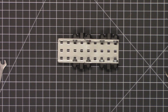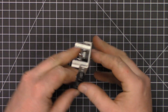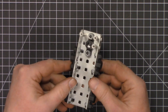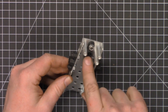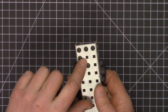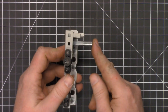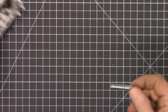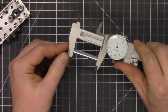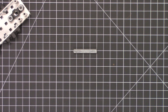Now we're going to work on getting the motor mounted. I've added three standoffs that are one inch in length in this orientation. We also added a bearing. This is one of those high-strength shafts, but notice I did not drill through for this one — that hole is still regular size, which is actually a great way to keep the shaft captive inside so it can't slip out. This shaft has been trimmed to 1.75 inches. I can confirm that with a dial caliper or by holding it up to the scale here — 1.75 inches is what we're looking for.